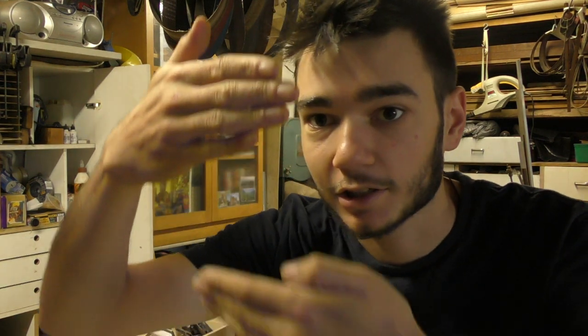And this is what's known as a blacksmith's guillotine. The idea behind it is it works like a very precise pinching jig. You have your ram, you have an anvil, and it basically just shuts off little areas. You can get different dies for them. You can get ones that basically just isolate material, which is what I'm going for, or you can get ones that have hot cut tools on them and stuff like that. You can buy these, or you can make one, and I'm going to make one today.